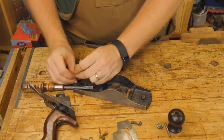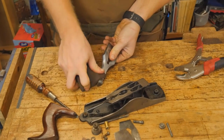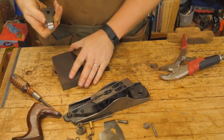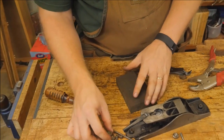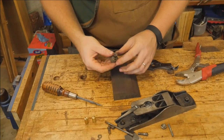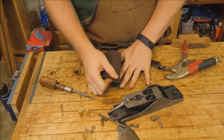Be careful with some of the brass pieces — make sure you don't ruin those. As you go, I like to take a sponge pad and clean up any of the surfaces that have a little bit of surface rust. Do some polishing, especially on the brass pieces and any of the smooth finished steel pieces. It gives a good burnished surface. The brass really shines up well with the sanding sponge. Sometimes I'll even take a very fine file to get into some of the nooks and crannies and give it a nice finish.